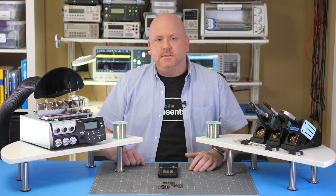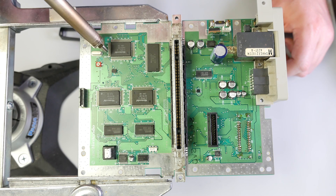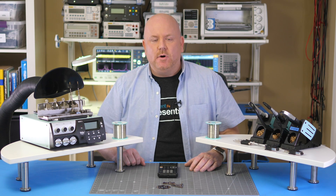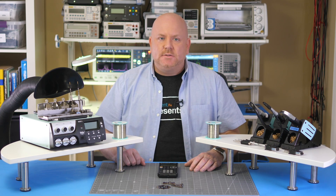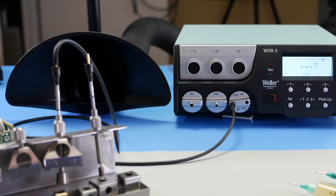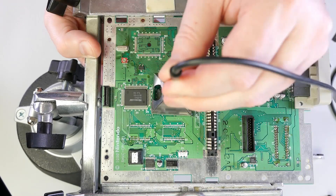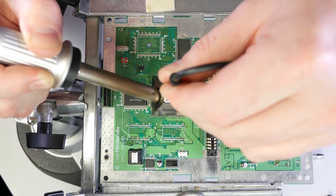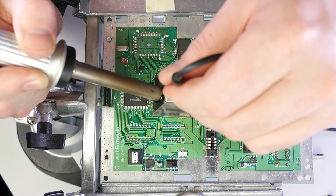I tried this same technique on some larger ICs, like these found on my old Super Famicom logic board. Just blowing hot air onto the chips did not work so well — they were just too large. That's when I started using the Weller WRK accessory set. Each piece creates a mini reflow oven around the IC, and there are several pieces to accommodate common chip sizes. This stick has a suction cup on one end and connects to the WXR3's pickup port on the other. The entire assembly sits on top of the chip, the WXHAP pokes into the hole in the side, then you press the button and wait. I found that when the flux starts smoking heavily, the solder is back to a liquid state, and using the suction cup's vacuum, the chip easily lifts up.